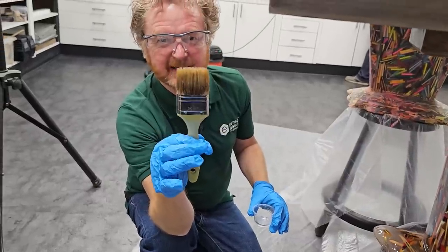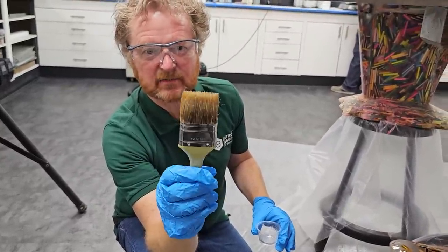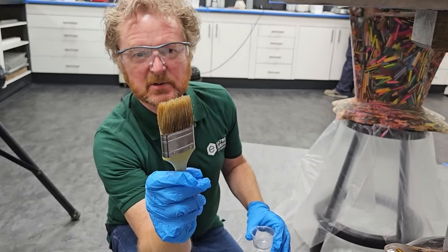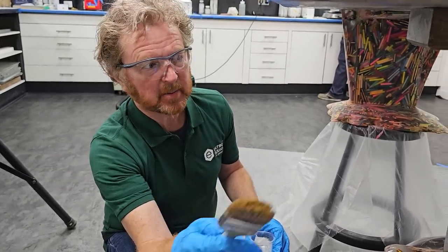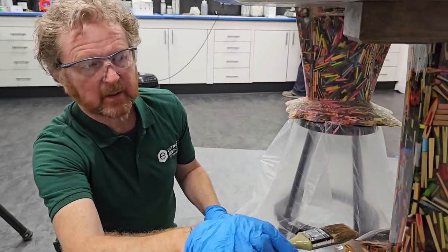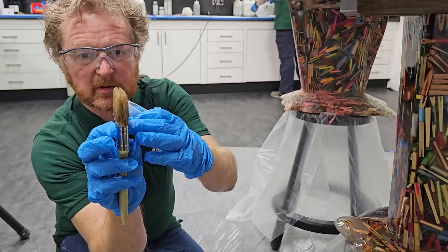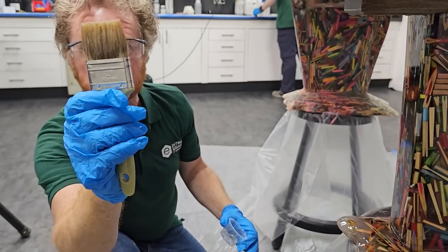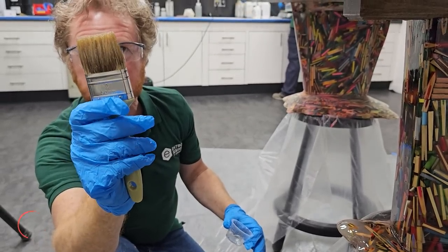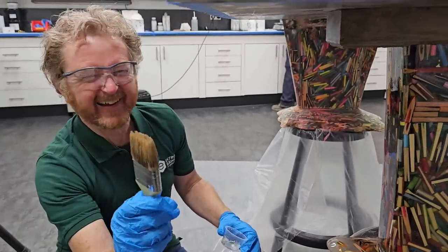Simple thing really — these are inexpensive white hair brushes. They're fairly cheap but they do have a habit of hairs popping out as you're using them. They're the perfect thing to apply epoxy onto a vertical surface. The way to stop the bristles falling out is to put the brush in a vise and nip up the metal bridle on the brush — that holds the bristles in a lot better. Top tip! Wow, I never knew that — we're getting lots of tips today.